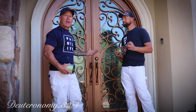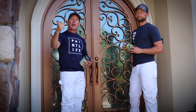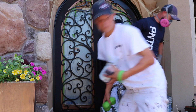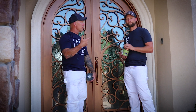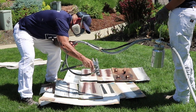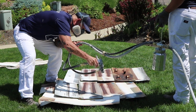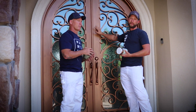This front door — you saw it before, it was black — now take a look at it, it absolutely looks amazing. We also did some metallic finishes on their fireplaces, which you can check out in another video, using a different process with heat-resistant paint. For this project we used an HVLP sprayer — a Titan Cap Spray — with a number five tip. You just have to play around with how much you thin it and where you set your pressure depending on what you're painting. We opened up the fan pattern more on bigger surfaces and closed it down tighter on smaller ones to avoid lap marks and missed spots.